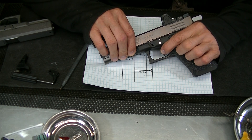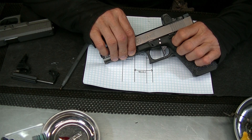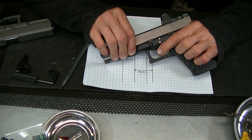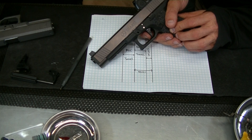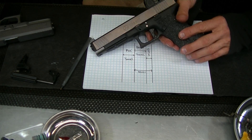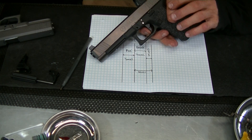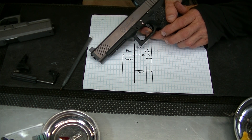This is the starting point — I have that lined up with the tip of the trigger just so we have something to gauge it with. From here to here is pre-travel, what a lot of people call take-up. Right to there you're on the wall. This gun doesn't have much of a wall. Then from the wall, all this movement here is break — and then over-travel.